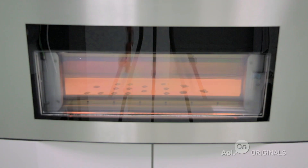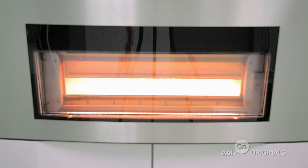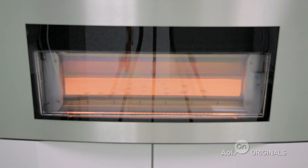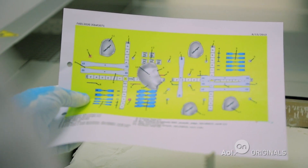We deposit a very fine layer of powder on the bottom — the platen of the machine — and then lasers will go and selectively melt the spot that needs to be melted. Then we'll add more powder and selectively melt those same spots until eventually we've grown the parts up and they're all sitting there floating in the bed of powder. This is a screenshot of the build layout software.